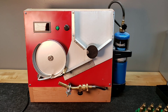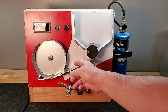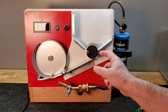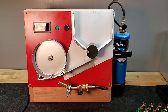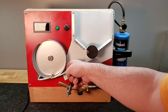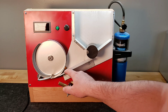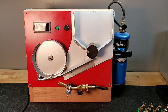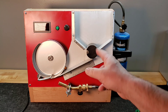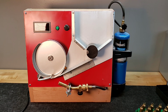Honestly, it's just as simple to load one at a time since you have to monitor this anyway. I really wasn't happy with the proximity sensor — it's just not reliable enough, because I have to push the case back against it a lot of the time. I've got the proximity sensor all the way flush, so one thing I want to try is building a small rail or putting some electrical tape there. I think if I get the brass at a slight angle it'll push back into the sensor better. I'll play with that.